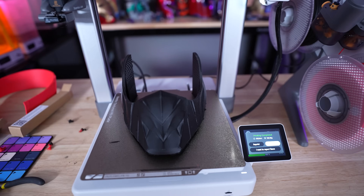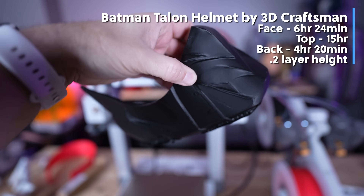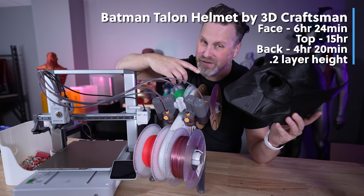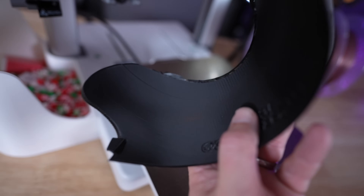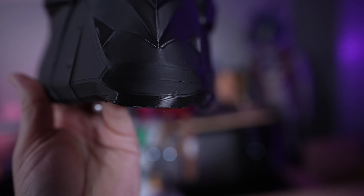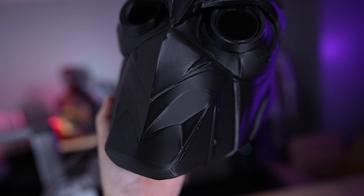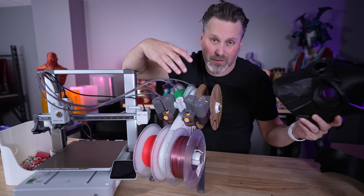I then found a multi-part Batman character helmet — the Talon — available in three parts from the Craftsman. The first try I printed the back at the wrong scale, way too small for my head, but more importantly I can see layer shifting occurring in that print. On the front of the mask I'm also seeing banding towards the bottom, though everything else looks super clean — and that banding has since completely disappeared.